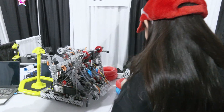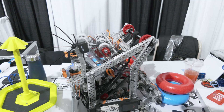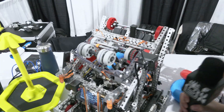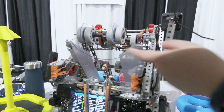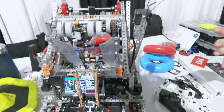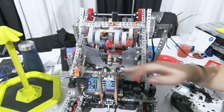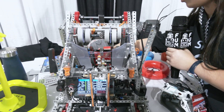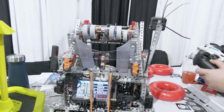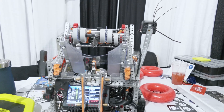Another really cool aspect of our intake is at the very top. Even though it's a roller intake, we still have a color sorter. Our ramp at the very top is double-layered — two pieces of polycarb — with one piece held in the middle powered by a piston. Whenever we detect our opponent's color coming through the intake, we activate this portion, which elongates the ramp so the ring goes straight over the goal. We can demonstrate: pushing a blue ring in, you can see how the polycarb activated — that's how we color sort.